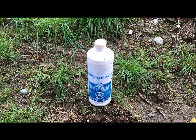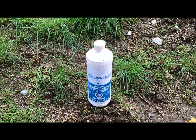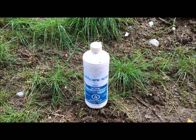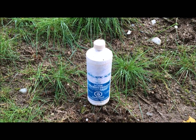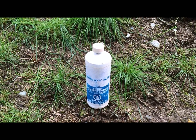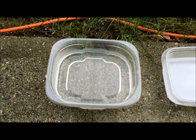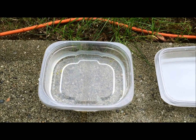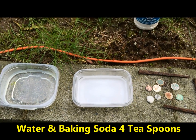Run about a 50-50 mixture — works really good and acts fast. Don't let it sit too long, otherwise it can somewhat deteriorate the concrete depending on how strong the mixture is. If you want, go maybe 30% muriatic acid, 70% water — probably a little better even if it takes longer. What I have here is about 60% muriatic, 40% water. To neutralize it, use baking soda — any type works fine.